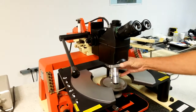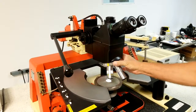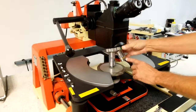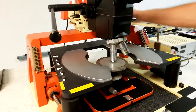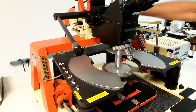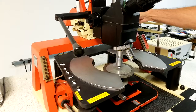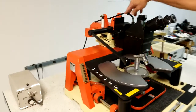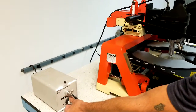The microscope here has a 50X objective installed and a 10X objective as well. You do your focus by adjusting this knob here — you've got a coarse focus and then a fine focus. We do have fiber optic lighting with the sources here, and you can adjust the intensity of the light by using your knob here.